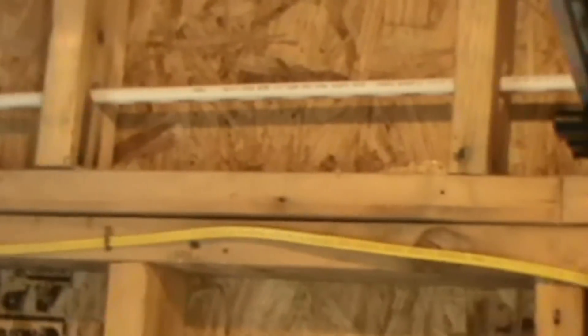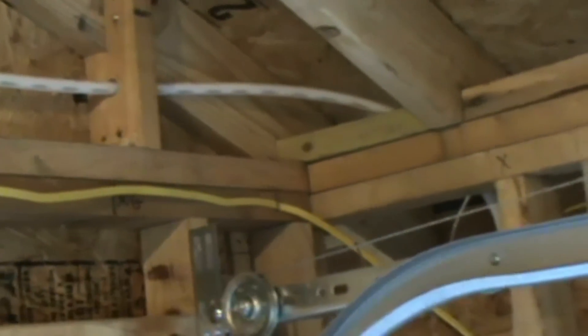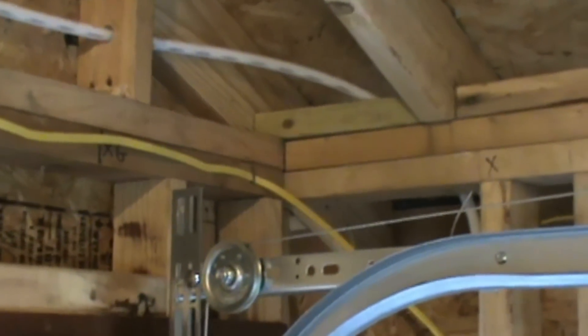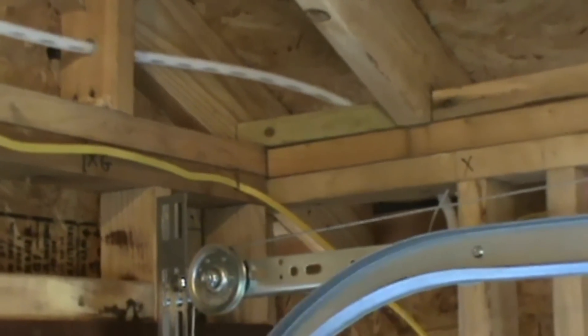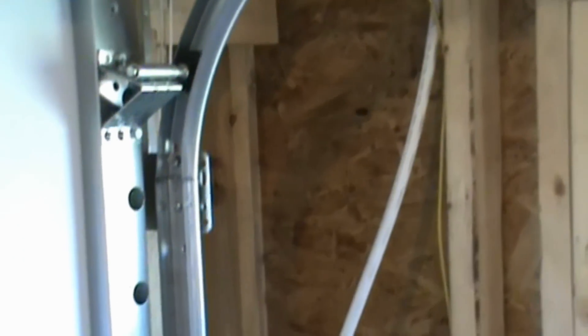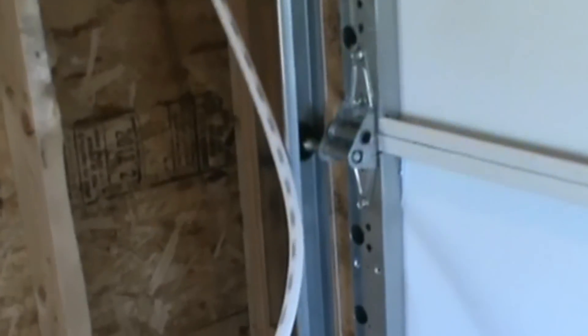I've been running it through these holes — it wasn't too bad to get through there. I could run on the outside of the studs but I don't have too many of those little clips that hold the PEX to the studs, so I just decided to run it through. Instead of putting elbows I just made long sweeping curves. That way you don't have to worry about leaks and it's a solid connection. It takes a little more tubing but it's actually cheaper because the elbows cost money. Those nice sweeping turns save you a little bit of money and time because you don't have to crimp together any elbows. Now I'm going to bring it down this wall and hook it in where my spigot is.